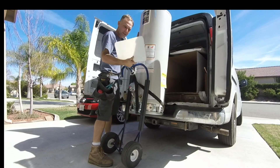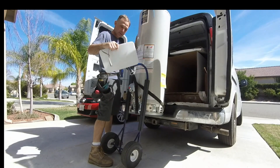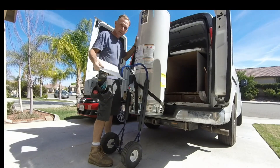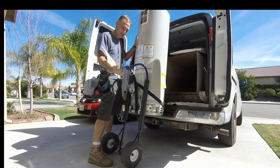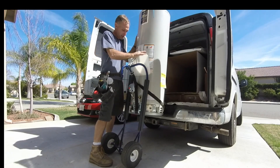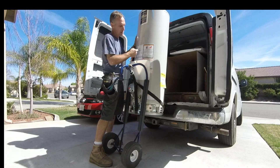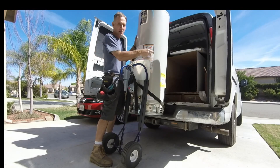This is a protective fender that I keep right next to where I set up here so I can reach it while I'm still in control of the tank. Hooking the anchor strap, pushing it down in front — about like that. Leave a little clearance. The tank will rock back on this and you'll never get a dent.